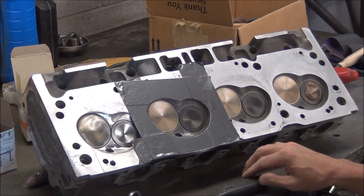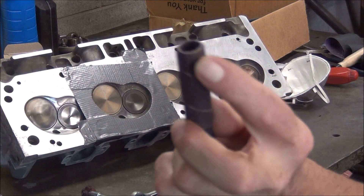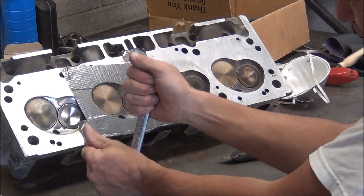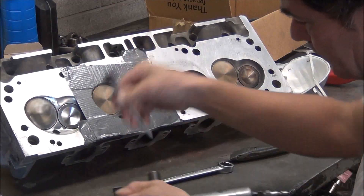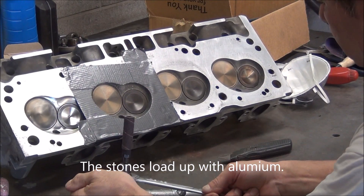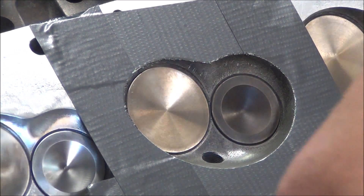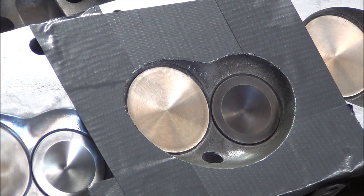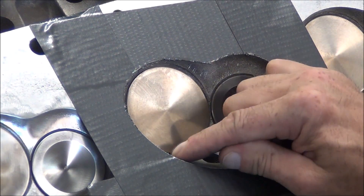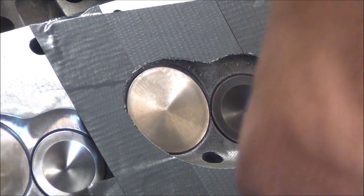First thing I want to do, I'm going to swap bits here. I'm going to use this sanding bit right here. It's a little rougher than I like, but it's all I've got. So there will be some sanding scratches that I probably won't be able to polish all the way out. I mostly just want to knock the slag out. Now we're ready to do some grinding. I've washed my glasses and I've got to put my dust mask on, so my voice will be muffled. It's a good idea to wear some kind of dust mask or respirator, because it's aluminum and grinding and sanding dust isn't good to breathe.